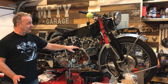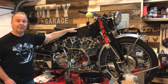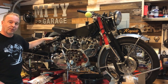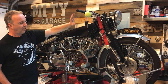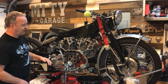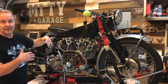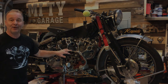Next job will be to actually start working on the top end. This upper frame member, this backbone, is an oil tank for the Vincent - it's held by essentially two pins here and here. We'll remove this rear suspension unit and lift this whole upper frame member including the front forks and front wheel away from the engine, suspend the engine with something under here, put the front kickstands down, and then we've got some work to do on the top end - install the push rods and start putting things back together again. Thanks for watching and I'll speak to you again soon.